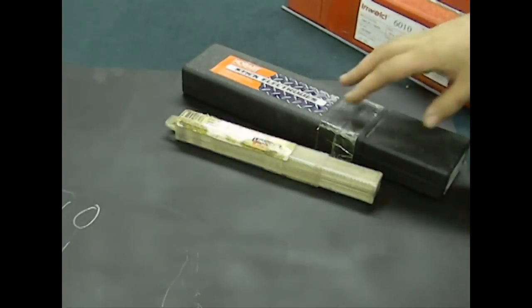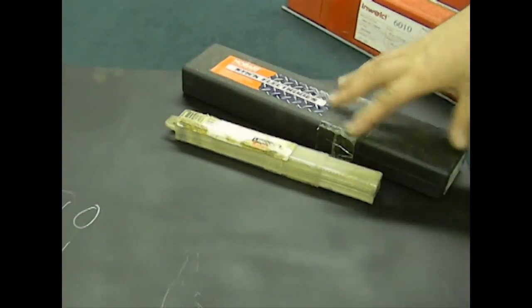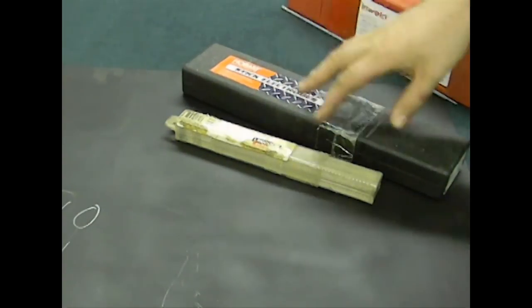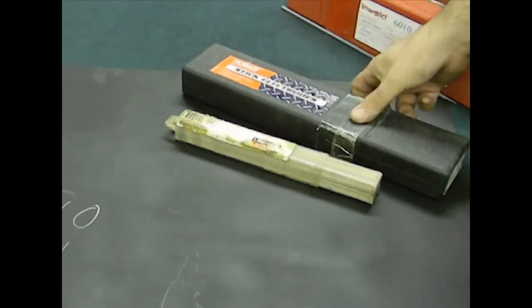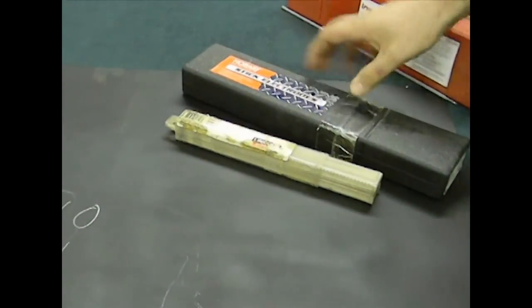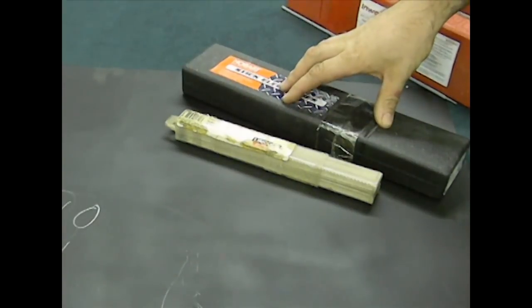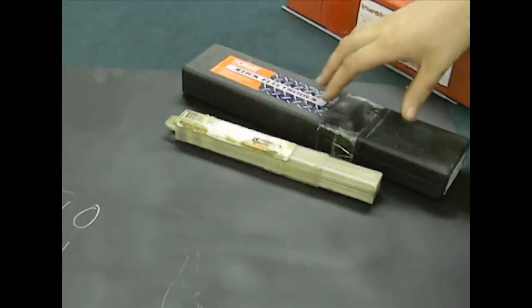How you choose to store your electrode will ultimately determine the lifespan of your electrode. These things do have a shelf life — they are affected by things like temperature and humidity. Now this is still sealed with the tape from the factory, so it should be good for quite a while. The flux will break down over a period of time, but it's well protected and I don't have to worry about these things going bad.